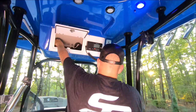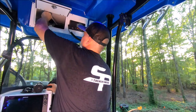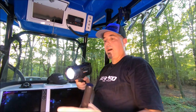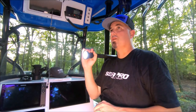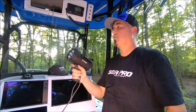Up in the electronics box you want a couple of important lights. You need both a floodlight and a spotlight for night running. The spotlight is 1,400 lumens — great for looking far away and spotting markers while running at speed. The floodlight lights up your whole boat but kills your night vision, so use it only when stopped. Running on plane, use your spotlight; when you're stopped and looking around, switch to the floodlight.